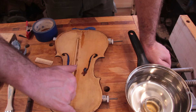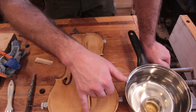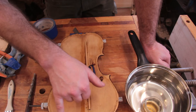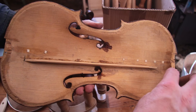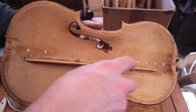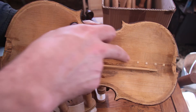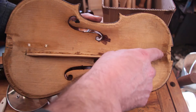So I'm going to let this dry. There are more cracks here, here, and back here — this is the first one that I noticed. You can see this area was built up in the past with some padding. So I'm going to figure out how to get the top to sit nice and flat down on the body. I have the top glued back together again. The center joint — I put in little cleats along here. I don't know if they're really necessary, but I figured it cracked once, so it wouldn't be a bad idea.